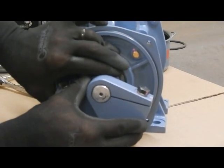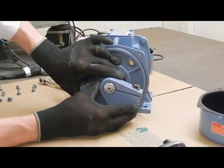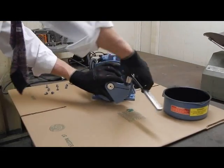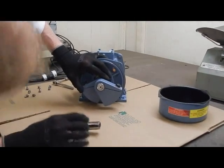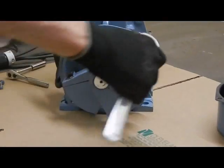Now I'm swinging this around. We set the other end to 70%, so we want to match 70% on this one as well. Double-check — the punch mark is lined up with the 70% scribe mark.